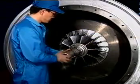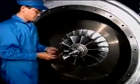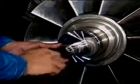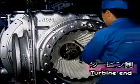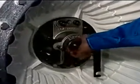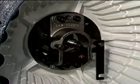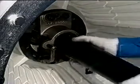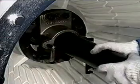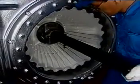Remove the centering tube. Screw the eye nut on the rotor at the compressor end. Remove the axial lock. Screw the guide tube by the box spanner onto the rotor turbine end. Fix the extension tube and clamp it with the socket screw wrench.